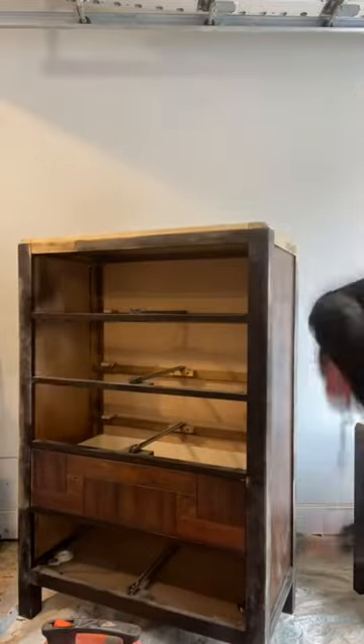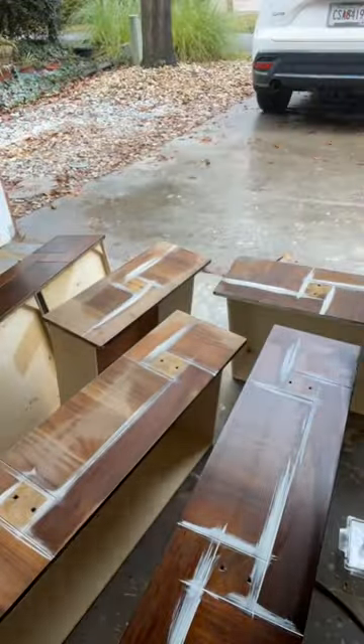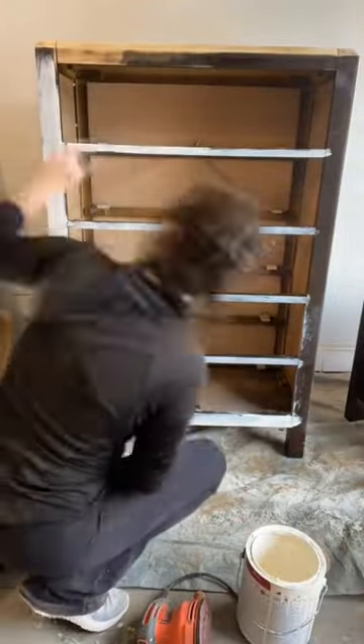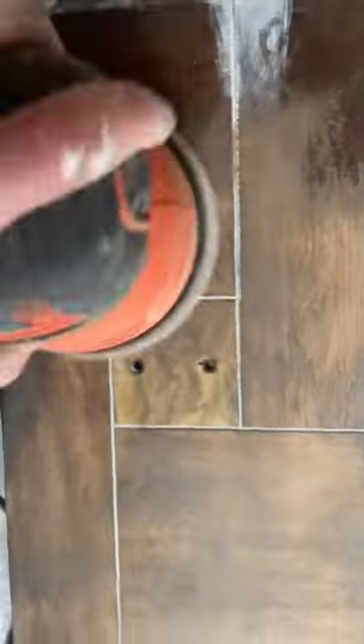But until then, we'll mark corn off the list. Anyway, first thing I did was sand — I sanded with 120 grit, there were some marks on the side, and then 360 to smooth. On the drawers, I wanted those little inside grooves to be painted, so I first painted them and then sanded it down to the raw wood.